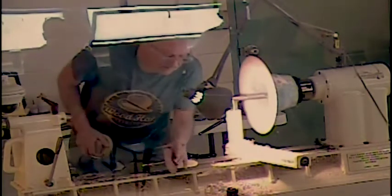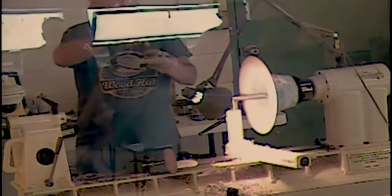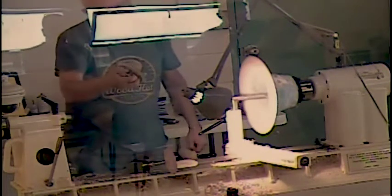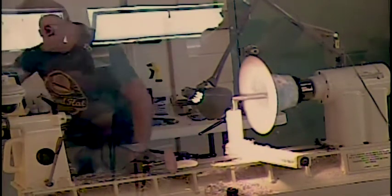And we're not going to use that 40 grit. That was for something else. That's another thing you can do with these backup pads. I do these knobs. Just turn a knob like that, tap the hole, 5/16, 24, put some super glue in there, backup pad, and these are great. It's almost as powerful as an electric device. You can really sand some flat work with that. Dang. I make a lot of these.